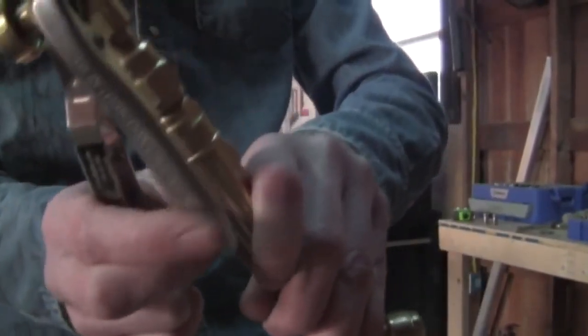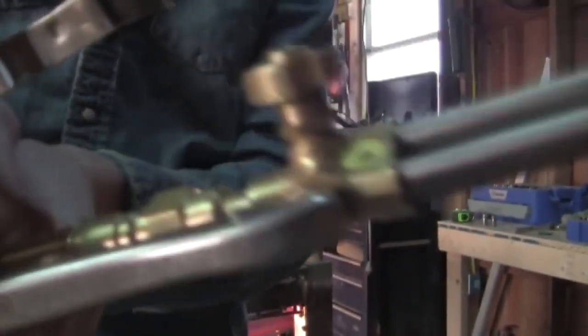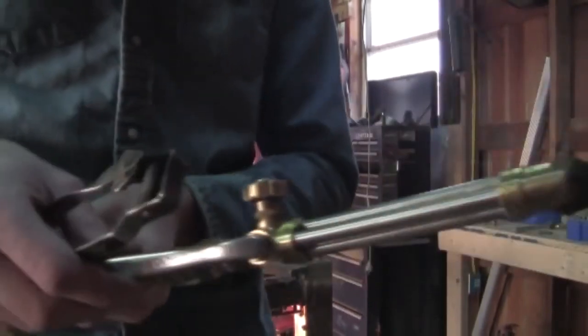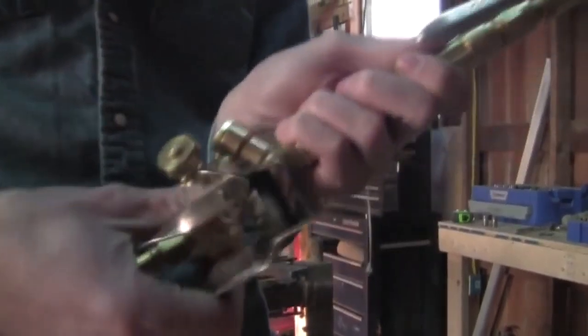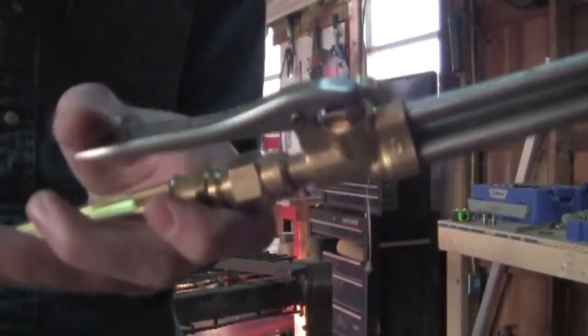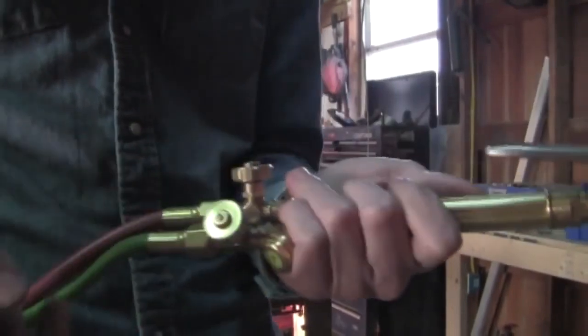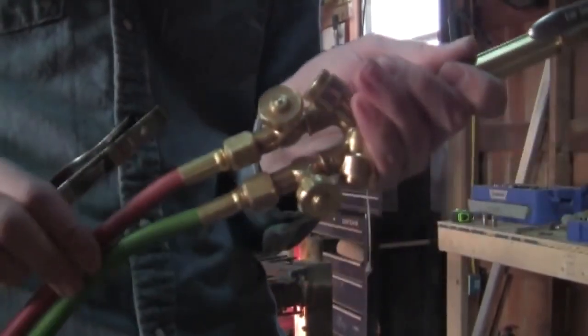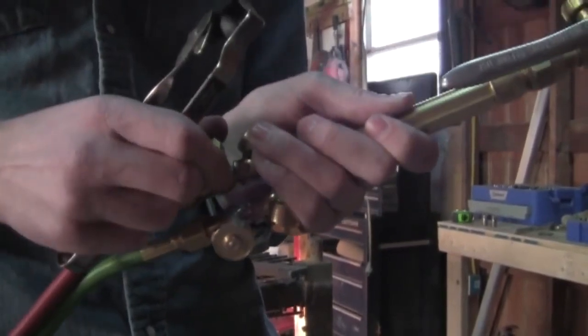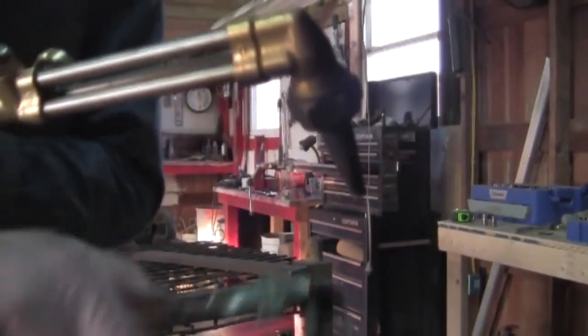This lever here is referred to as your cutting oxygen lever. Basically, you're going to make sure your green oxygen valve is open all the way to the point where, when you push this lever, you hear that windy oxygen noise. Then to light the torch itself, you're going to turn on the acetylene valve a little bit — just open it to your gas and light it.